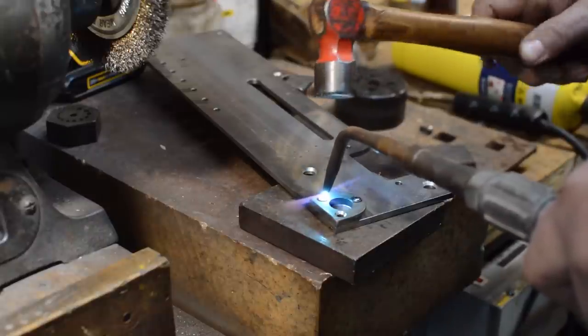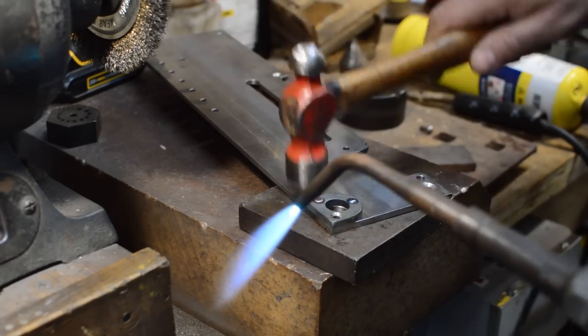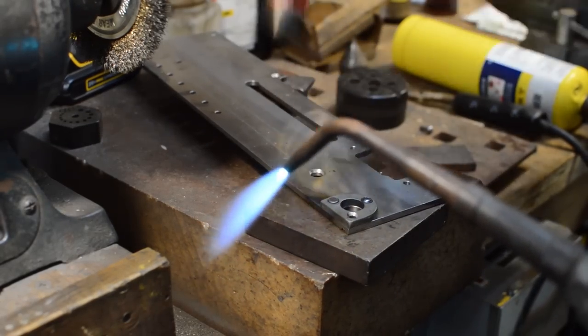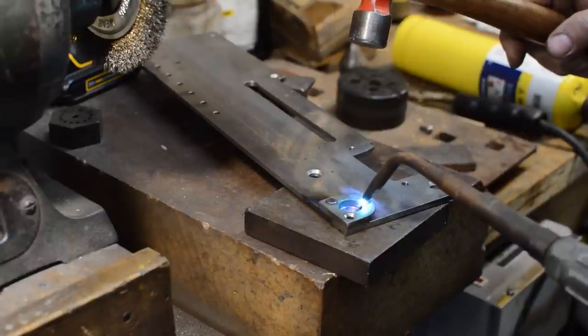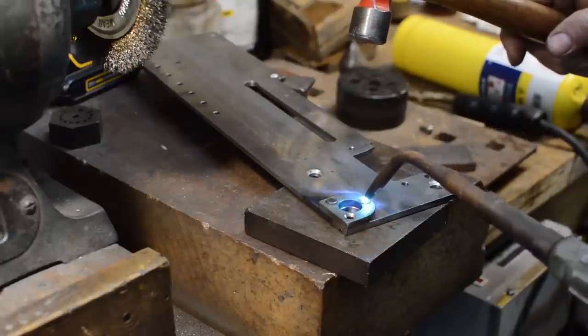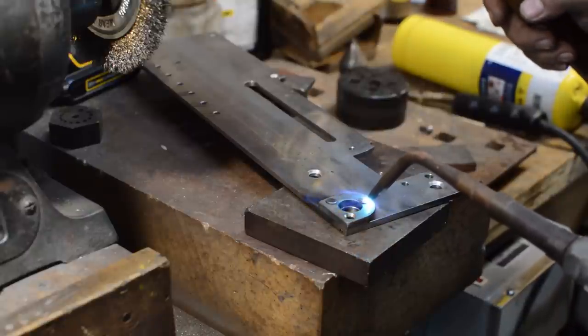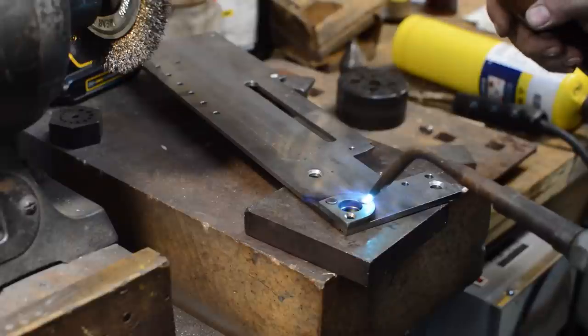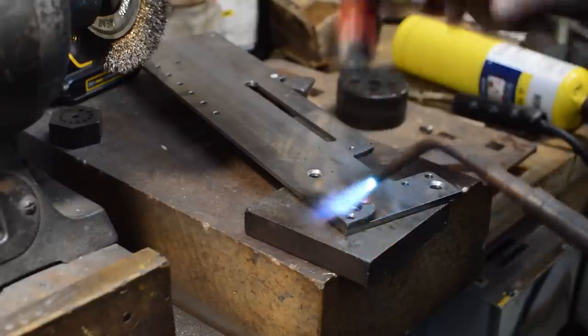And that's what we're shooting for here, is to be able to take this metal when it's malleable and pound it in. Now, we're not really worried about what this is looking like on the outside, because this whole plate's going to get polished, sandblasted, and parkerized. You won't even know I was here. This gun's been through hell in its life, and I'm hardly part of the problem.